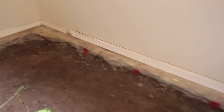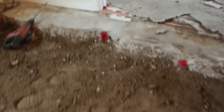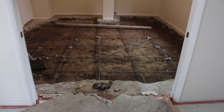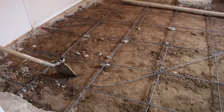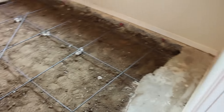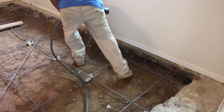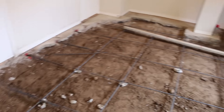There's the jackhammer working — as you can see, it's a little thicker in some areas than others. What we're going to do is clean up the edges really well to start with, and then we're gonna put some concrete glue around the edges. We're also gonna drill some holes into the concrete about four to six inches deep, and we're gonna slip some 3/8 rebar in about every two feet all the way around this perimeter.